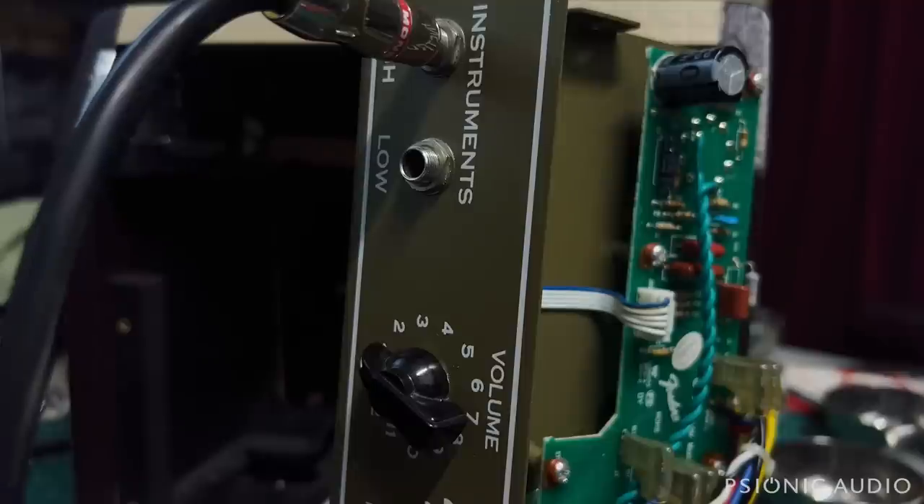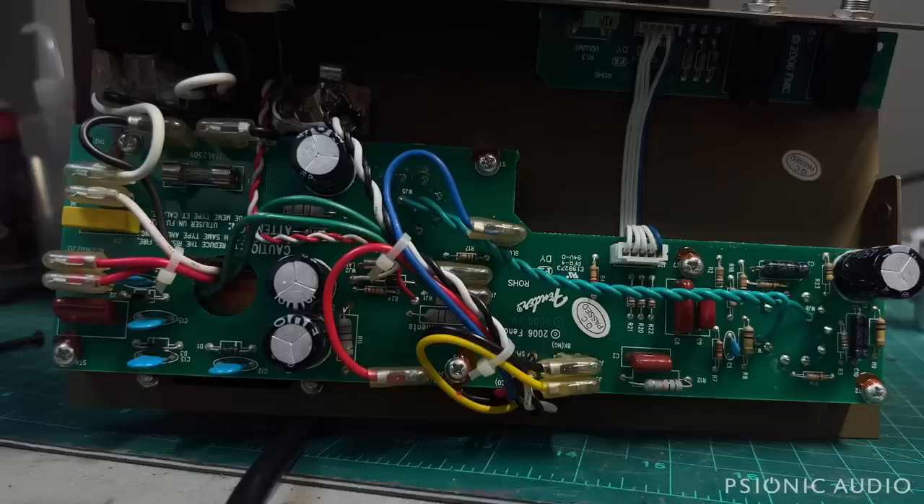Let's power it off and take a look at things. I've got real bad news for the owner — it's nothing in the tubes or the preamp. I can mute the three grids and the sound stays constant. It's going to be a filter cap; it could be part of the rectification circuit, or it could be a bad transformer. Let me take a few measurements and see if I can narrow it down. It's such a simple little amp, but the time spent diagnosing can exceed the value of the amp itself.